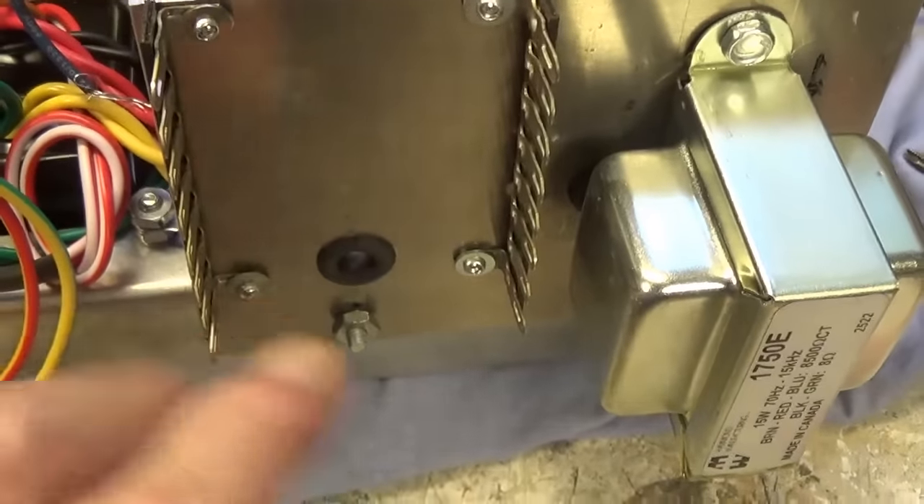The power rail is completed. Let's check the wiring against the schematic to make sure no mistakes were made. The B-plus comes in here from pin 2 of the rectifier tube and goes through 30 microfarads to ground. Then we go through a 1000 ohm, 2 watt resistor to another 30 microfarads to ground. Then through a 10K, 2 watt resistor to the final 30 microfarads to ground. We have nodes already connected: the center tap, this node that will go to the screens, and this node here that will power our preamp section.